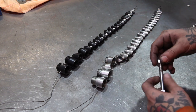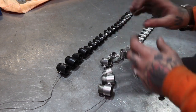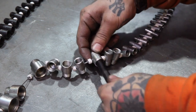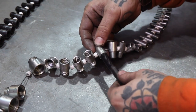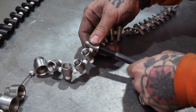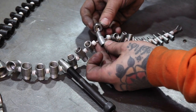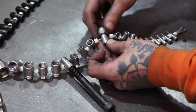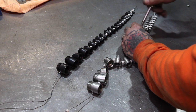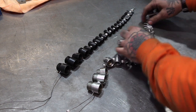While I'm machining up a thread on the lathe, I can quickly grab one of these, pull the inside thread, check the fit, make sure it's not binding up in any spot, and then usually it's pretty good to go. It's just a great dummy-proofing way to go about that. If you just literally had something like this in your home shop and you had a bolt and you weren't sure if it was going to be imperial, metric, whatever size — you can come to this. I know this is a 3/8 16 and that just threads straight in there, and then you can go find your nut for it.